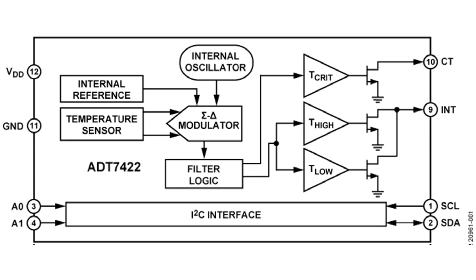Inside there's a temperature sensor and an I2C interface. There's a 16-bit analog-to-digital converter. It has calibration built in, so you don't have to do any extra calibration after you've soldered it onto your PCB. That's kind of what makes this a great sensor. There are two address pins, so you can use up to four of these sensors on a single I2C bus. With the 16-bit ADC, you get 0.0078 degrees C resolution, with plus or minus 0.1 degree centigrade accuracy.